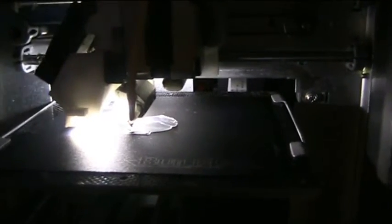With the correct calibration it is printing beautifully. I am really impressed with how the foundation layer is going down, and the foundation layer is normally the layer that I have trouble with. I am going to let this go for a few more minutes, have another quick look at it to see if it is still successful, and then we will look at the finished prints and do something bigger. Eventually we will also do ABS just to make sure that it accepts the Up brand of plastic as well as this generic plastic that I am printing in.